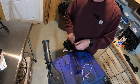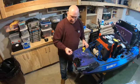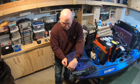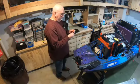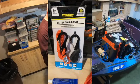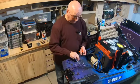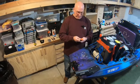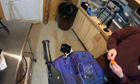Then we just need to add — that's a 3/32 inch Allen wrench. Next, we're going to add these cams. What we need is a jeweler's screwdriver. We'll save this paracord and use it for something else down the line, but we don't need it for this. The only part we're after is this cam.